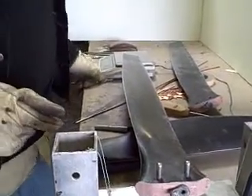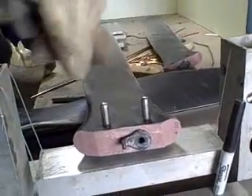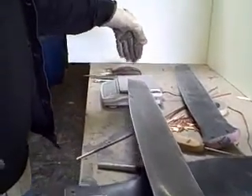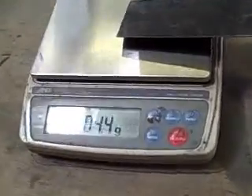This is how we balance the blades by the moment method. You see the pivot point if you draw a line through the bolt holes, and then we lift that up a little bit, and then we lean the tip on the scale. That comes out in grams, and then we write the grams on the root of the blade.